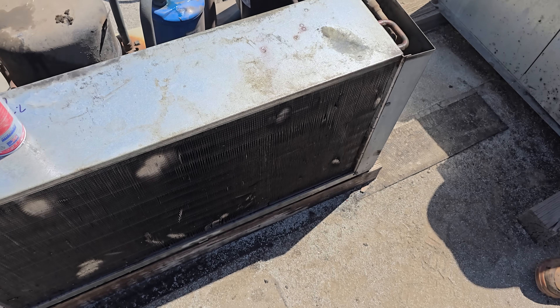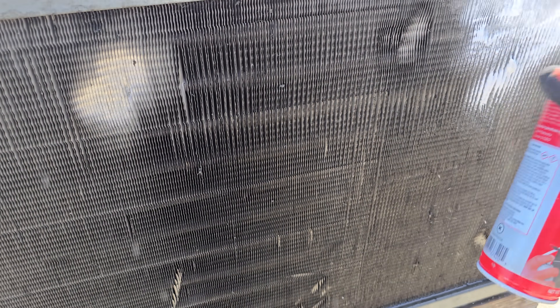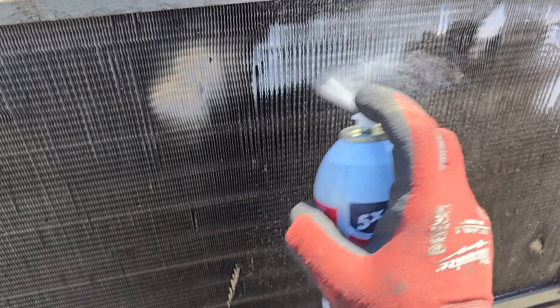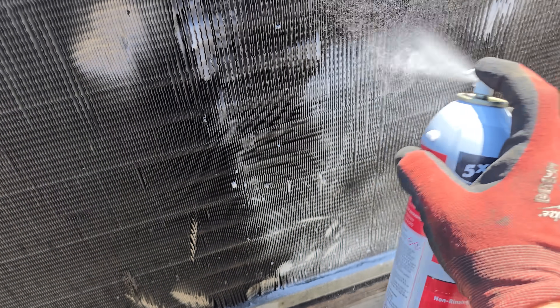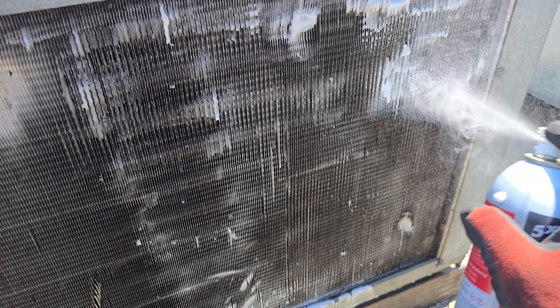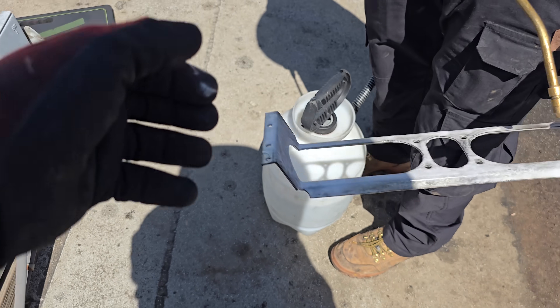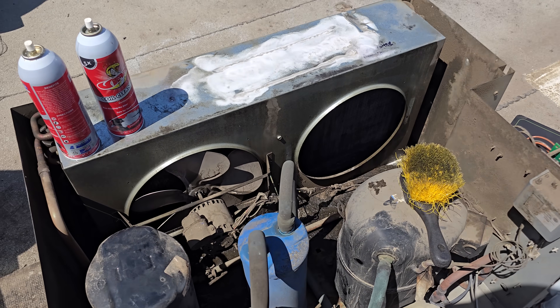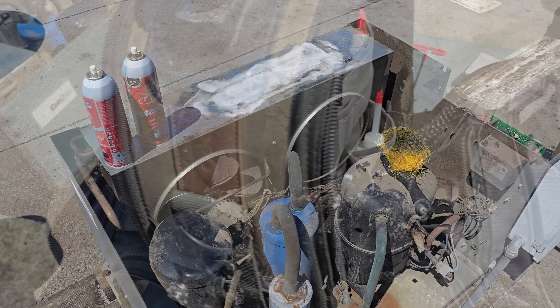Same thing on the other side - the other one hopefully has a little more in it. I'm just trying not to waste what's left in this can. The second can is a little better - spray it on there. We're getting a stream through. I can see light through it, so this is more or less just getting the surface stuff off. Let it sit for a second, then we'll rinse it all off. Coil cleaner can also be used to clean the brackets - just giving those a quick brush and rinse. I can already see light through this condenser to the other side, so it's not plugged. We just thought we'd give it a rinse since we had the pump sprayer up here.